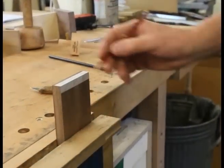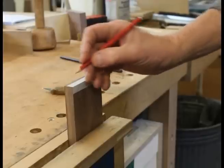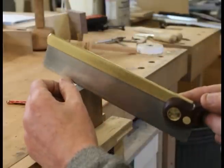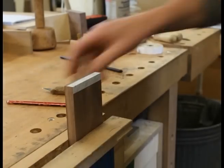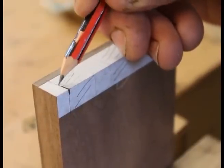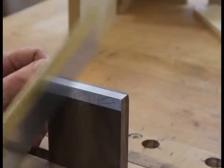The pins are all marked up and we've got to saw out the waste. On a through dovetail we can saw straight through, but with the lap dovetail we can't. So we're going to saw diagonally from corner to corner on all of them, and also take a few saw cuts in the waste to break it up because we're going to have to use a chisel to get it out — taking a few saw cuts helps us remove it more easily. The edge of the saw cut should be just on the line; the rest of the cut is in the waste. It's quite important to saw to the line — if you saw away from it you'll spend a lot of time paring back.